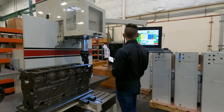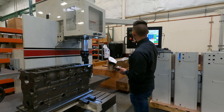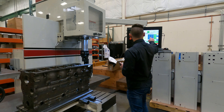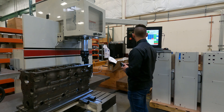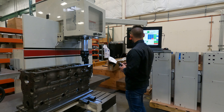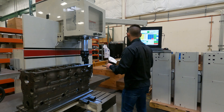Then we'll do the same thing — find the low point here, get our spindle zero again, zero out, and sweep back up 180 degrees. This one's good — we're actually at zero here. Which again, we would make it match depending on how much we've taken out of the cap.